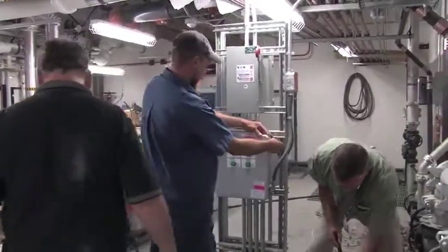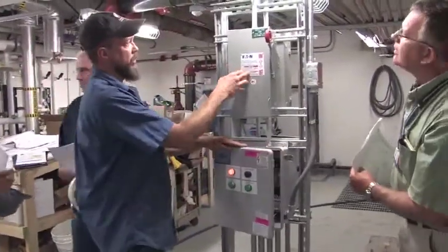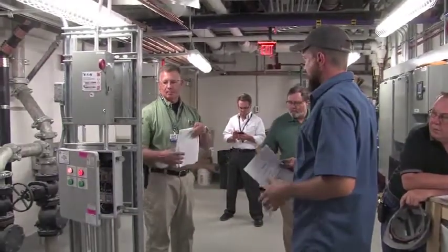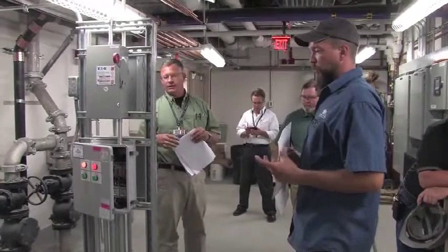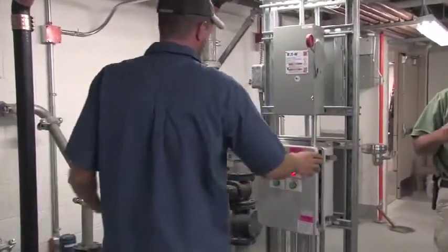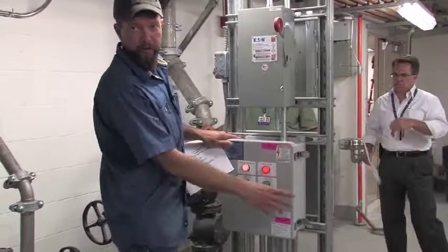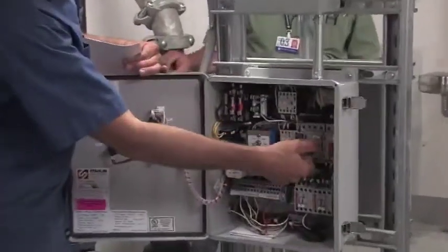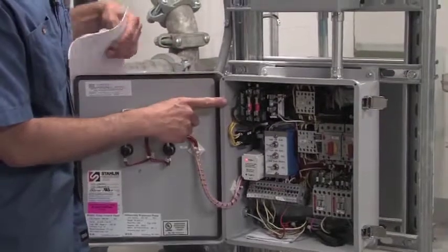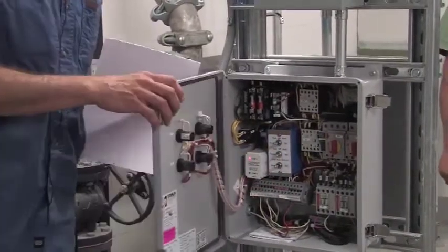Again, this is sewage here. The only thing I might recommend is labeling where your breaker box is. So this is a sump — this is just groundwater and it takes the indirect waste from the fire tank. Again, duplex submersible — these are one and a half horsepower. Duplex panel: control power and high water alarm, pump run indicators. Incoming voltage, individual disconnect overloads, motor starters. Step-down transformer for low voltage for your HOA switches, lights, alternator, and coil voltage for your startup. HOA switches, alarm test, silence button, and horn on the side.